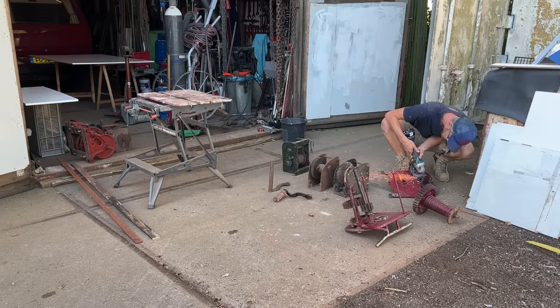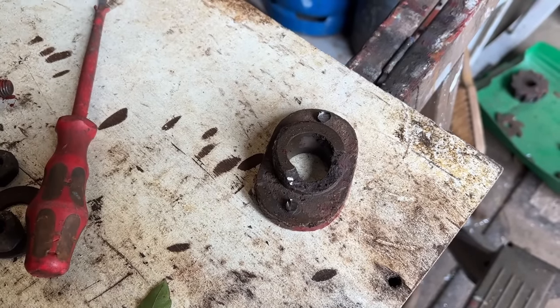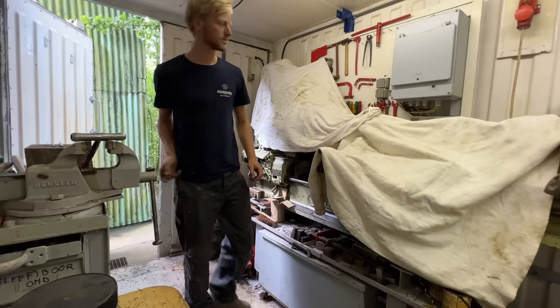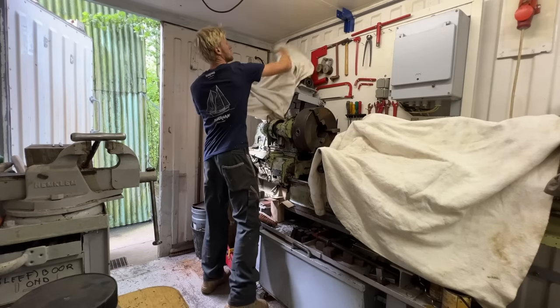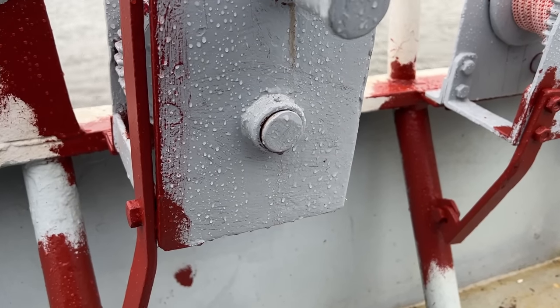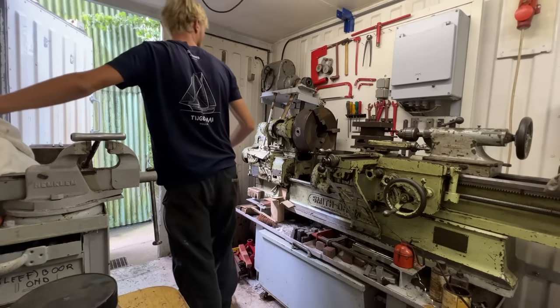Fortunately, only 1 winch has a broken bearing. All the other ones are still in quite good condition apart from some rust. Almost all these winches have plain bearings, either from steel or cast iron. A plain bearing is very simple, just a shaft turning around in a bush, that needs to be lubricated with grease or oil to make it turn freely.